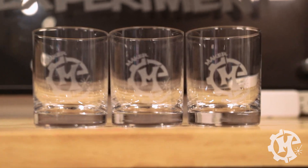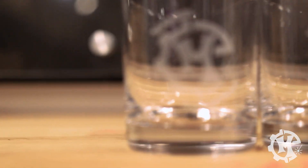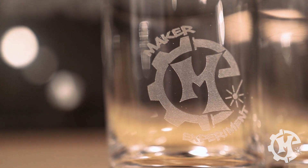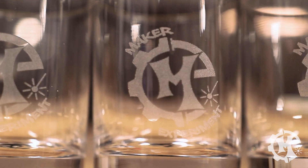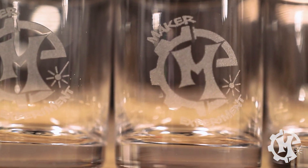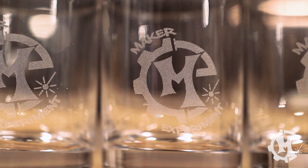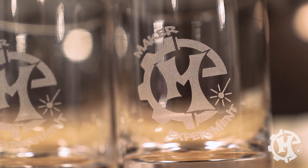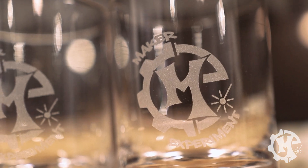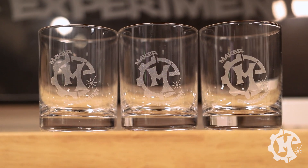Here's test number three. In order, we have one, two, three left to right. The first one on the left has the lines in it — 300 DPI, standard settings from the machine. Test two is a 70% black graphic at 300 DPI, which spaces them out a little better but is too spread out for a nice frosty look. Test three is the same 70% black graphic at 400 DPI with the Jarvis dithering pattern, and it turns out like a nice frosty look. That is the setting that I typically always use.